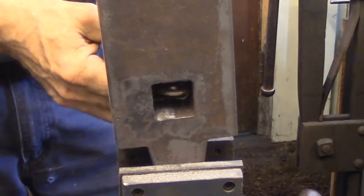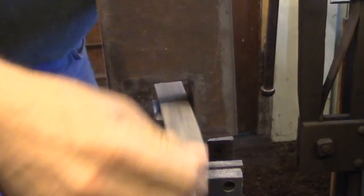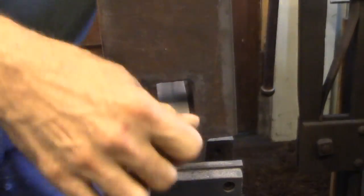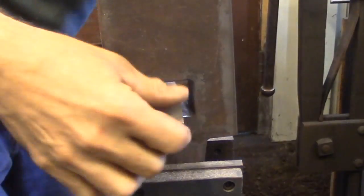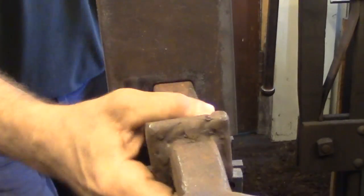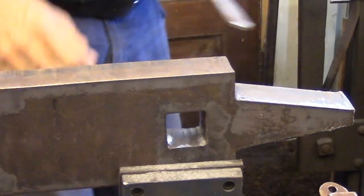So I finally got to the filing and I really underestimated how much time this was going to take. I basically just did three holes: the hardy hole in the anvil, the square hole for the base of the anvil, and the hardy hole that was going to hold the swage block. Those three I definitely need to be able to use this unit. The other two holes in the surface I can get done at a later time. It took me probably the better part of two hours. So if you have a machinist friend or somebody who offers to help, definitely take them up on it.